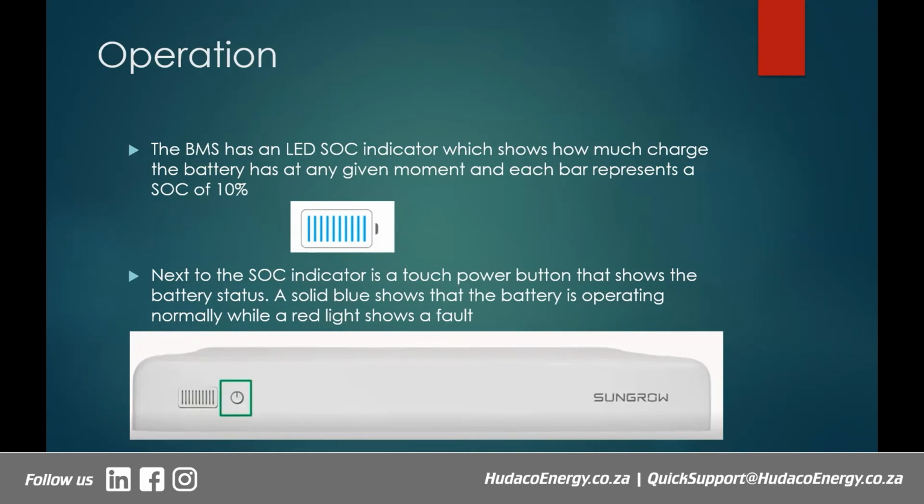So this is the top cover that you see here, the white part. The top cover has got 2 parts which both act as indicators. You've got the one on your left with those bars. It's a state of charge indicator, right? Each bar represents 10% state of charge. If your battery shows 1 bar, it has 10% power. If it shows 2, 20%, 5, 50%, 7, 70%, and 10 of them, it's 100%. It means your battery is full.